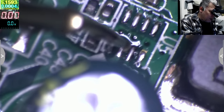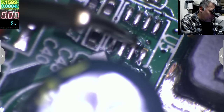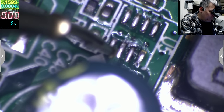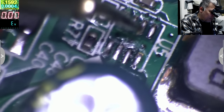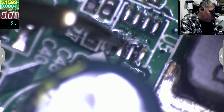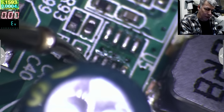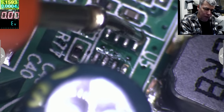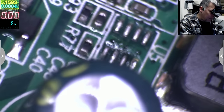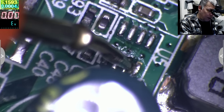So the plus is coming here. Yeah. The plus is coming here, so the chip is burned and is closing the circuit here with this pin to the ground. Yeah? So here is my short. But I don't understand what the coil has to do here. Probably nothing. So this is plus, and plus is coming. This is plus, this is ground. What about the coil? Where does the coil have to go? Let's see here, nothing. Here, nothing. Nothing here, nothing. So that chip just was shorted and was shorting everything. The coil had nothing to do with it.